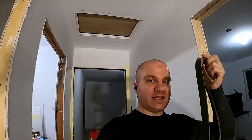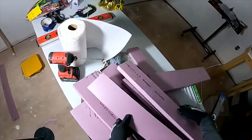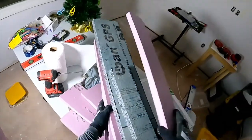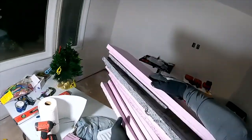That took about two hours, and that was with recording, streaming, and fussing around. You'll probably already have some insulation on top of your attic hatch — it might just be a little bit of bad insulation — and it's very likely you won't have any foam tape, which will be the biggest impact. If you can throw some more rigid foam or batt insulation on top, you'll definitely notice a difference. I have enough scraps I could have made at least one more layer, but I didn't have enough caulk and it's already at R50 — anything more would exceed the attic itself. Maybe I'll build a birdhouse out of the scraps.